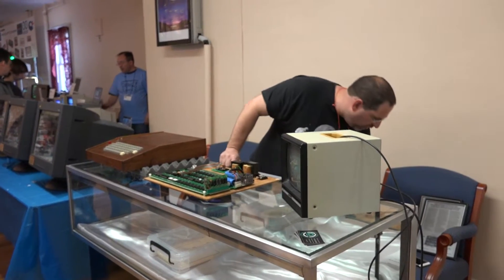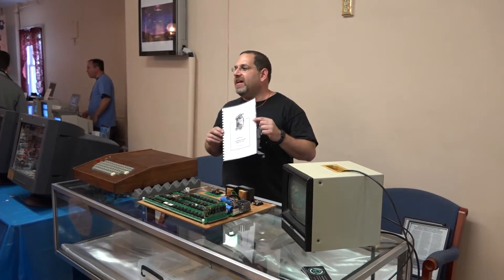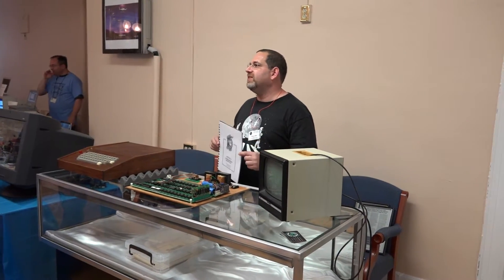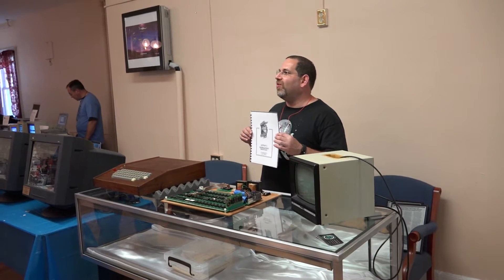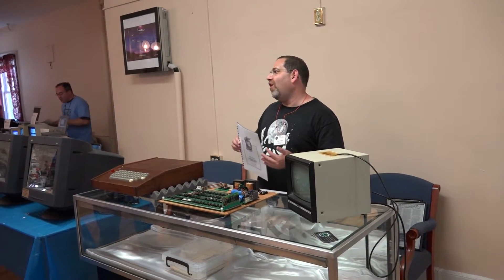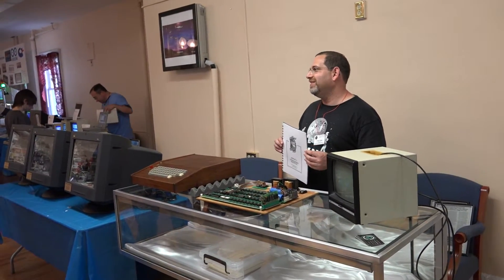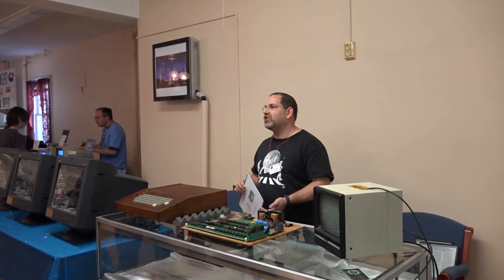Apple did include a checkout program and a guide. Interestingly, you could have bad RAM chips and it still works, because the commands used only use a couple - like six of the bits. They don't use all of the bits, so you could have a couple of bad RAM chips and if you lucked out, you were good. So running BASIC is the only way to actually prove it works.